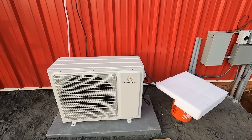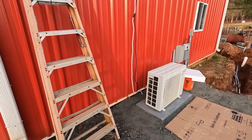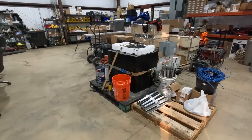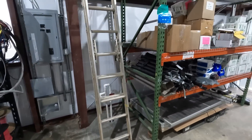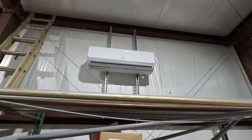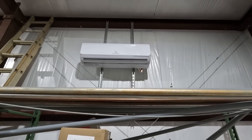I've got a DC disconnect and an AC pull-type disconnect, so I can run it on either or both. I'm going to get those line sets connected — these are not pre-charged like the Mr. Cool, so you do have to pull a vacuum and charge the line set with 410A. Now in the warehouse there's a little bit of moisture — you know how sometimes the floors will just sweat — so I wanted to deal with that. I mounted the indoor unit on unistrut; the backing plate is bolted to the unistrut. You can see daylight through there, so I've got to insulate that — I'm not done, this is just the beginning.